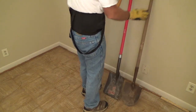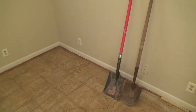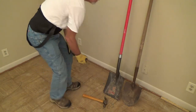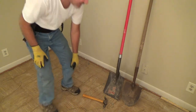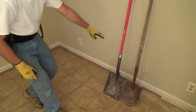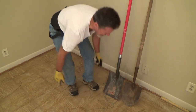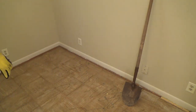Time to remove the tack strip. That's all I can find. I also got a hammer here. You don't need a little chisel or a cat's paw or a flat bar or whatever to bend down like that. You can use a shovel. If you have a shovel, a square one like this — it's maybe only this wide — works good, or even a point. Let's try the point and see how well it's going to work.